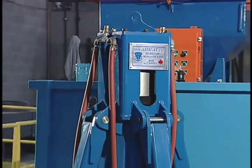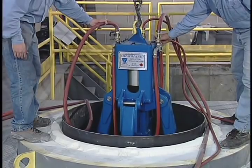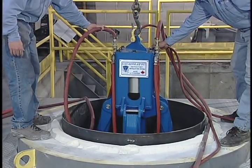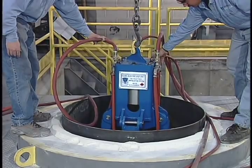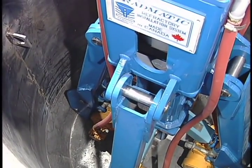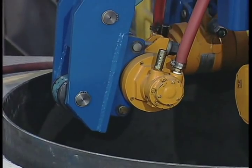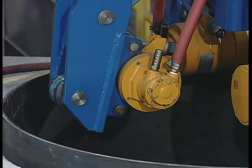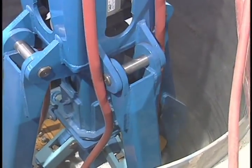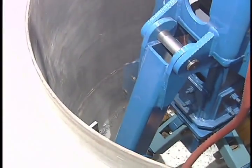The final step in the four-stage system involves vibrating the furnace side walls. Gradmatic uses a four-legged unit, each equipped with a pneumatic eccentric air vibrator. The unit is lowered to the bottom of the furnace with vibration beginning one inch above the base of the form floor. Spring-loaded legs extend against the interior of the form to deliver equal force to the four contact points. Furnaces of nine-ton capacity or smaller use a three-legged unit.